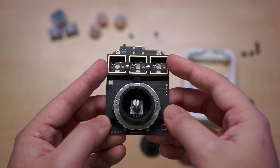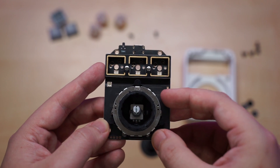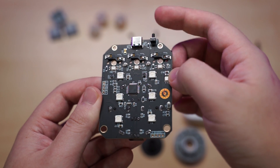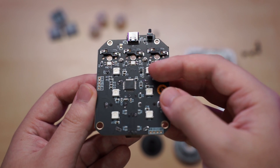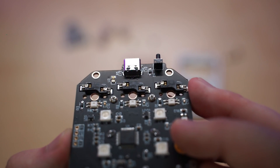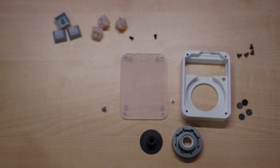Here is the main PCB, which has the three switches on top with the FR4 plate and the knob in the middle. At the back of the PCB is the Type-C port, next to the mode toggle switch and the six LEDs for the underglow RGB. The hot-swap sockets used are Gateron sockets, which is good. Here's a quick sound test before I move on to my final thoughts.